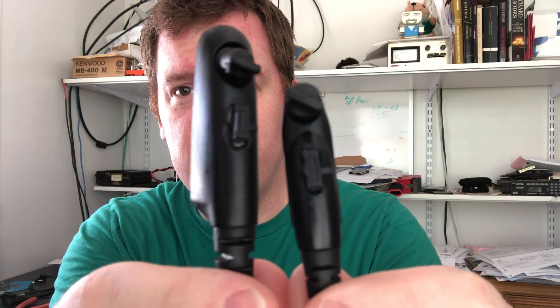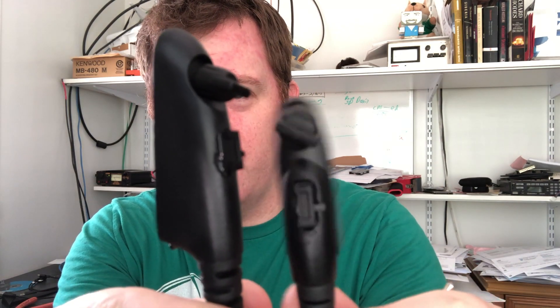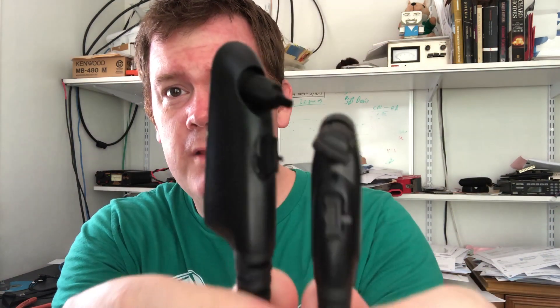Pretty easy if you have a flashing cable. This is actually my favorite cable that I make — it's a 5-in-1. It does CDMs, professional radio, and another radio — I think they're a little cheap radios. It does the EX series with this little connector. What I've added on these, if you can see, is two little switches — epoxied in there — and I've also added an extra pin, which allows me to go to ground to be able to flash the radio. So this is not only a programming cable, but it's a flash cable, and it's FTDI-based. It goes right to USB.